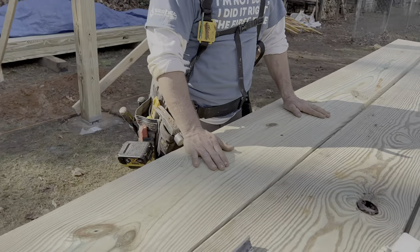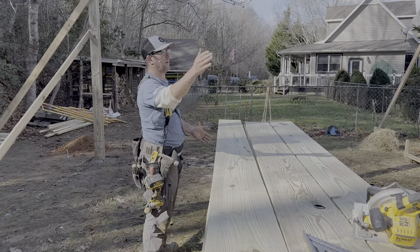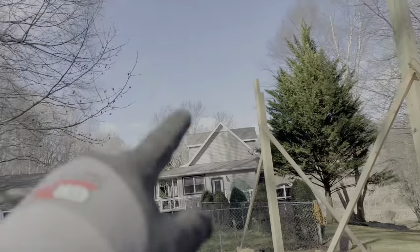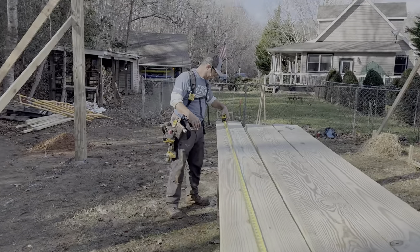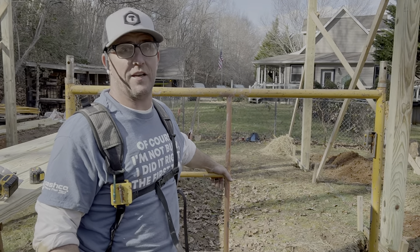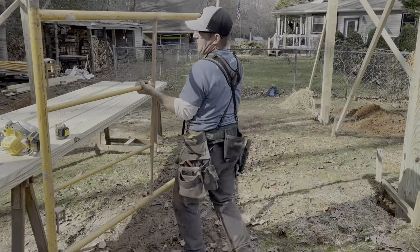We got it done. Next is the girder. These are all 12 foot on center, so we should be able to cut all our girders at 12 foot. This first one goes flush to the outside of the first post and breaks in the middle of the second post — middle to middle, middle to end. We just gotta lift all this wood up to these spots. One thing we noticed is that we put all our braces on the outside, so now we can't get to the girder easily — we'll be screwing from the back side. If Jamie was here he would have told us to do it differently. Live and learn.